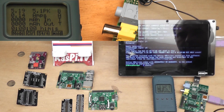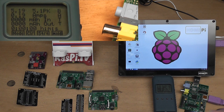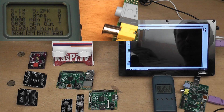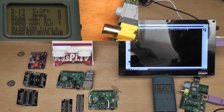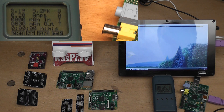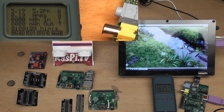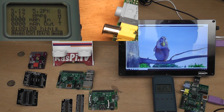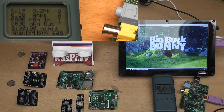We'll start the GUI — LXDE — and that stabilises at 140 again. Big Buck Bunny time — it goes up to 170 while it's busy. Pushing the GPU it peaked at 240, now stabilised around 200 milliamps — fluctuating between 170 and 200 milliamps, sometimes going slightly over.